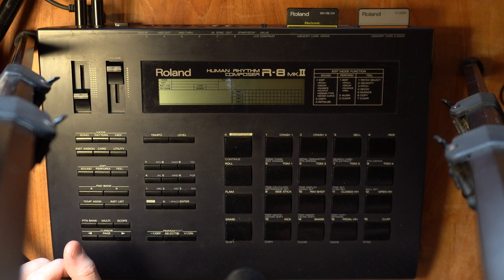Then you also have the power input, which is on a weird 3-pin connector, and the power supply is somewhat weird too. It's a plus minus 10 volt DC supply. It's a pain if these die, or if you buy a machine without one. They're not easy to find. So bear that in mind if you do find a machine. Make sure it's got the original power supply.